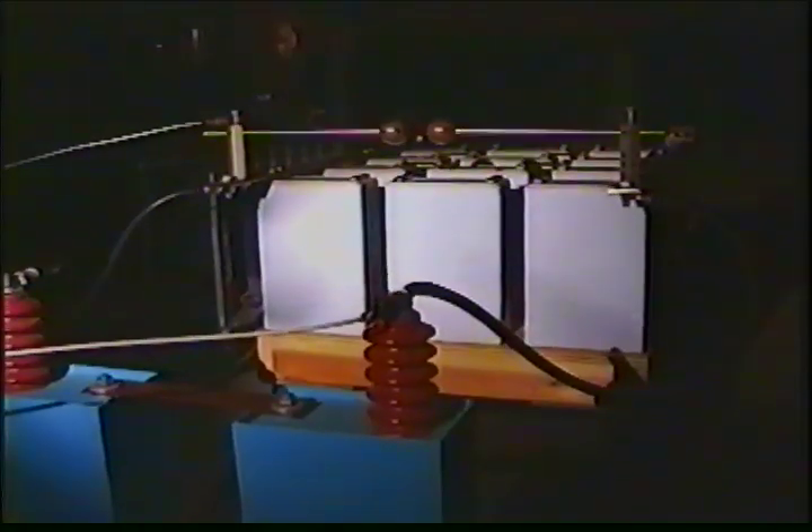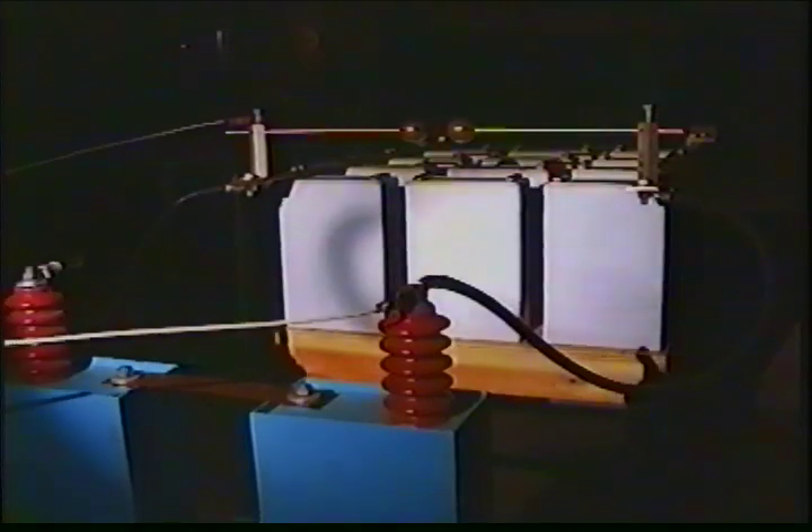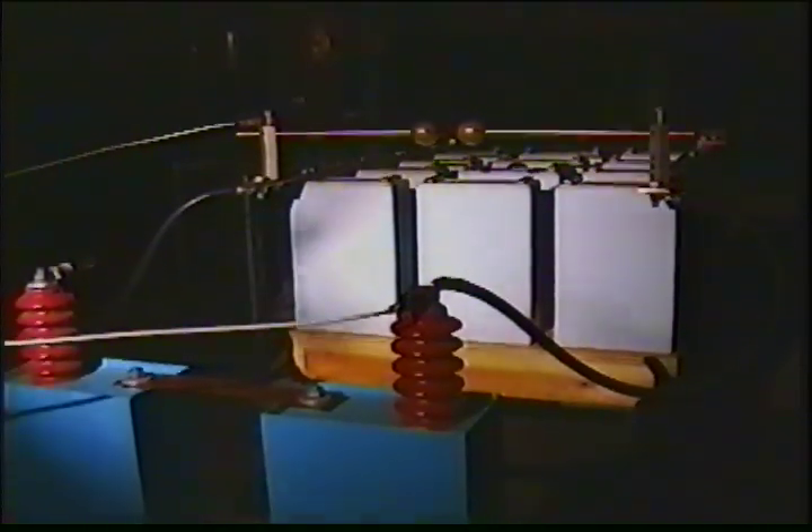What you're looking at here is the high voltage capacitor bank. The white capacitors are being used along with the two blue capacitors in the foreground for a total capacitance of 0.270 microfarad. This is the oscillation capacitor bank that works into the Tesla primary and oscillates in a Colpitts-type circuit — essentially a relaxation oscillator based on a certain amount of capacitance and inductance.